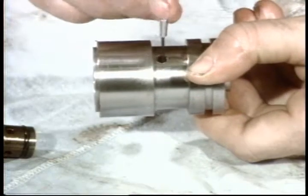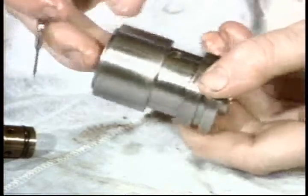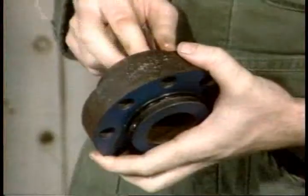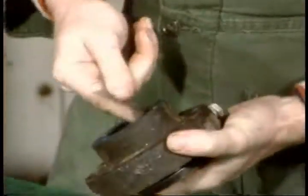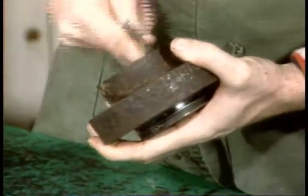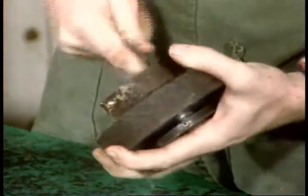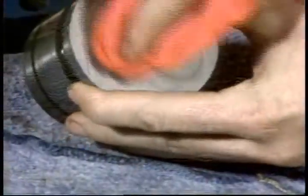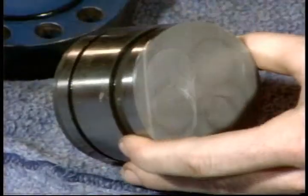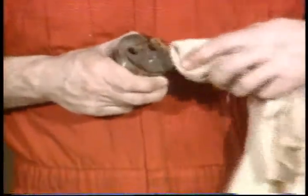There's also a venting system through the pilot valve body. Make sure those small passages are unclogged. If you have to, you can use emery cloth or steel wool to remove mud or dirt buildup. But make sure the emery cloth or steel wool is soaked in solvent, and use either gently. And never use emery cloth or steel wool on the seal rings or plates. If they're so dirty that you can't simply wipe the dirt off with your rag and solvent, then replace them.